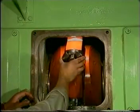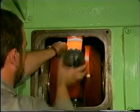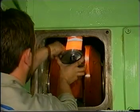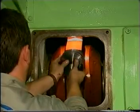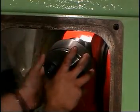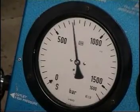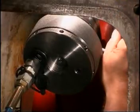Mount the spacer rings and the hydraulic jacks, positioning the slots of the spacer rings so that the Tommy bar can be applied through them when the nuts are to be loosened. Make sure that the parts engage correctly. Unscrew the jacks 3/4 to 1 revolution to allow for the contraction of the studs. Vent the system if necessary and increase the oil pressure to the prescribed value.